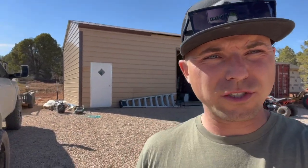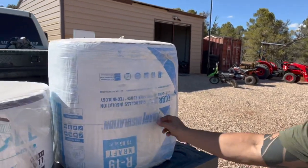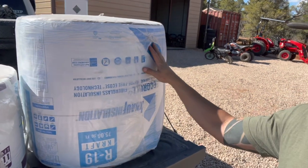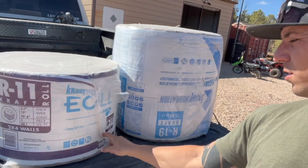Now that we've got the layout of our solar components figured out, I went and got some fiberglass insulation — Knauf insulation. R19 is for the two-by-six exterior walls, 24 on center. The R11 is for our interior wall — it's a two-by-four wall, 16 on center. We're going to do the 24-on-center exterior wall first, then put blocking on top of that, finish with plywood, and then we can start hanging components and running wires. It's exciting — let's get to work!